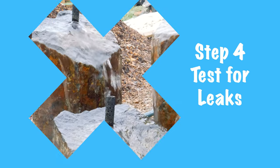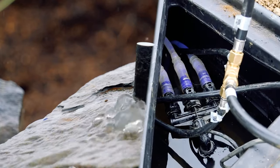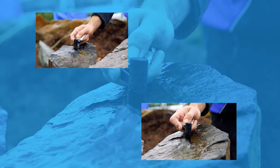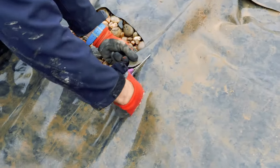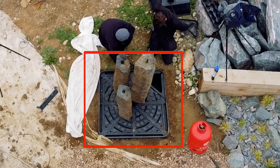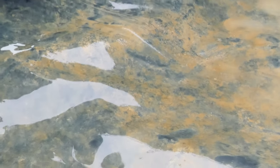Test the gas and water flow — you can adjust the water with the valves on the pump and also the gas from the gas regulator. This is the splash curtain: we use that to retain as much water as possible from the splashing of the feature. It will be bigger than our aqua basin and leveled slightly facing towards the basin, so any water splashing onto the curtain will slide back into the basin.